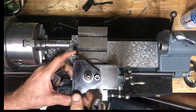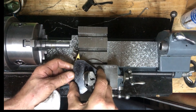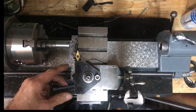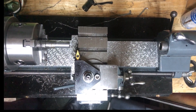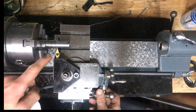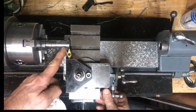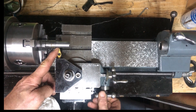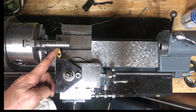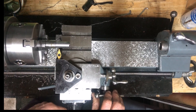I've also made use of this tool holder, and adopted another tool one millimeter lower so it fits. I want to show the threading possibility with the one-axis setup. When the tool has reached its leftmost position for a right-hand thread and stops, there is a setup time that you can program yourself — I've set it to one and a half seconds. The ELS then displays 'retract tool,' so I retract the tool, and then it moves automatically back to the starting position.